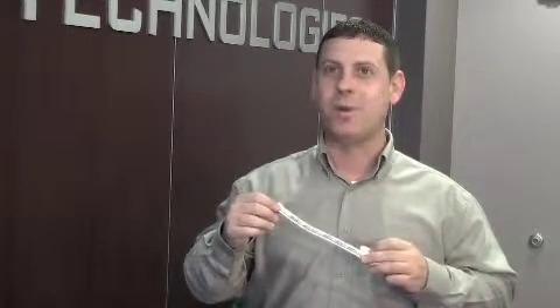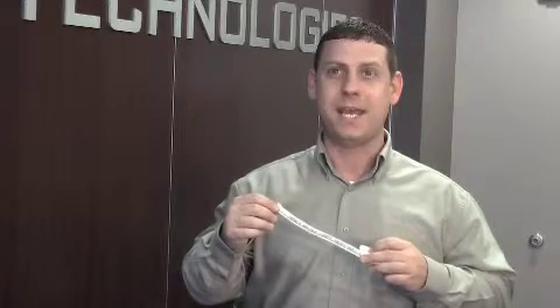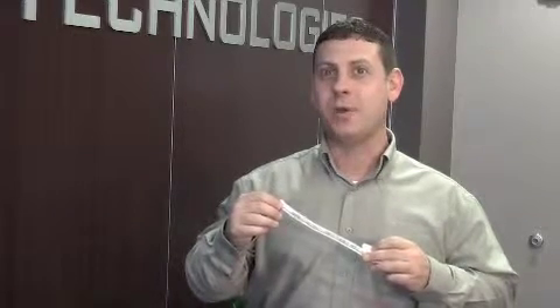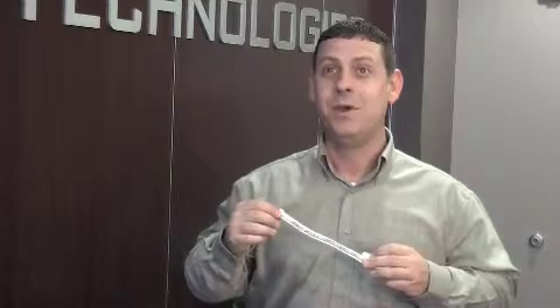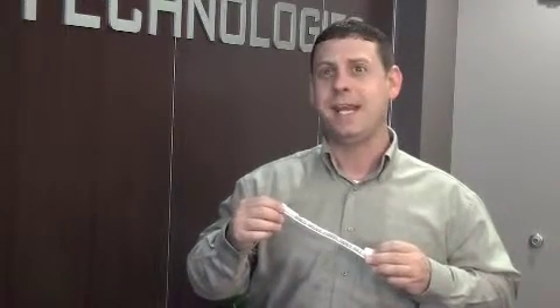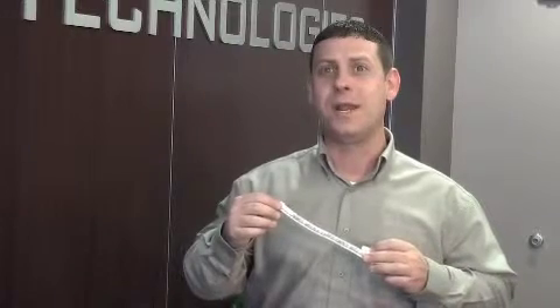In this segment we will be discussing our Bull Line Pull Tapes. Bull Line is a woven polyester fiber or woven aramid fiber tape that is used to pull a cable through a conduit. It comes in many different sizes and tensile strengths, ranging from 500 pounds to 6,000 pounds. Bull Line can be purchased in a variety of continuous lengths and can even be pre-installed into a conduit at our factory.